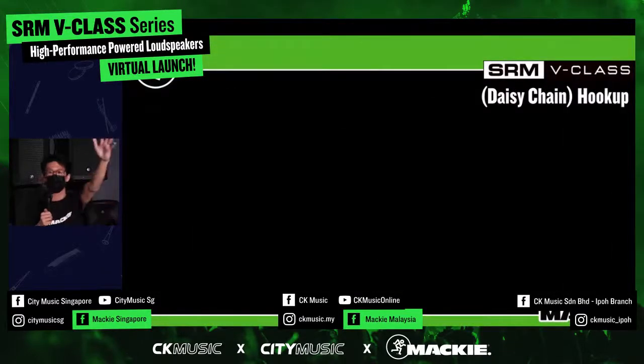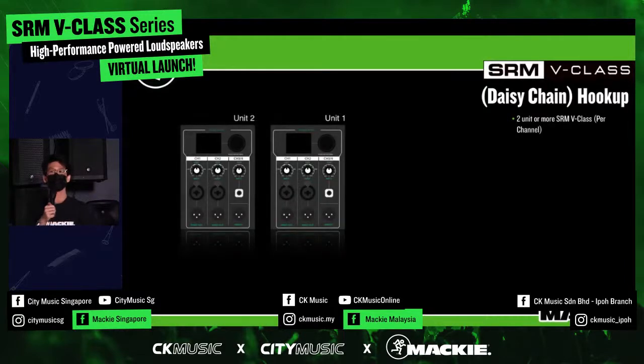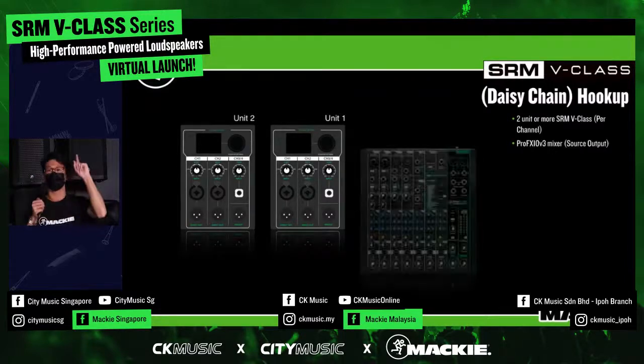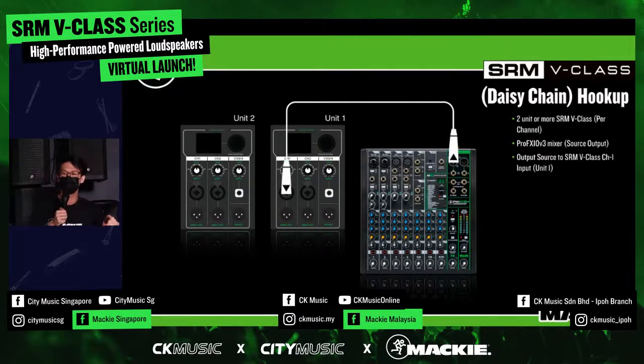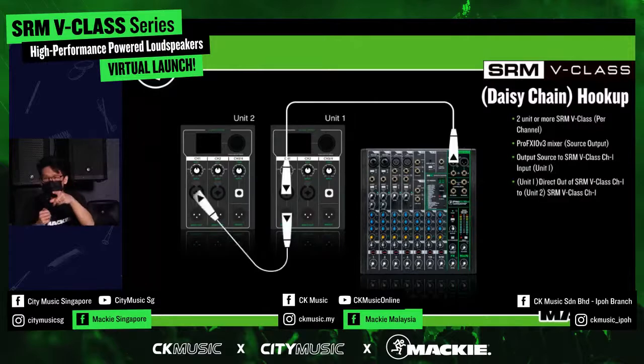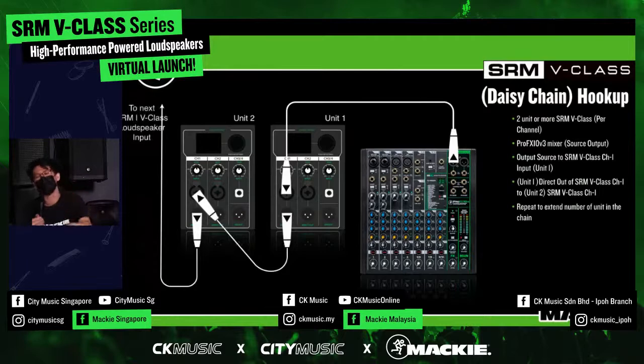So let's say you're using these speakers in a big event or big space, and you need to hook up multiple speakers across the entire area. Well, the SRM V-Class can be daisy-chained. All you have to do is, from your mixer, send your output to channel 1 of the first speaker, and each channel has its own direct output via XLR, and that can go to the next speaker, and then that channel also has a direct output, and you can go to your next speaker. And here's a fun fact for you guys. There's no limit to how many speakers you can hook up. Just go and go. So that's how you can do the daisy chaining of the speakers.